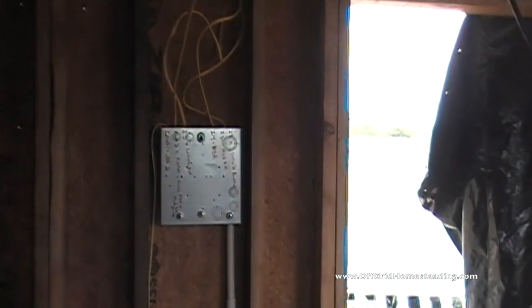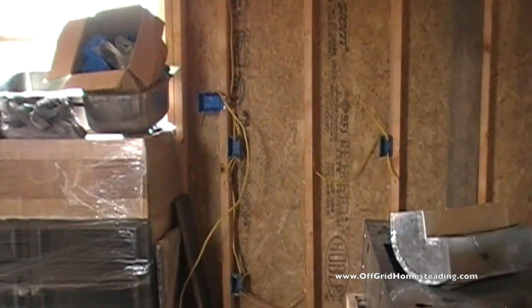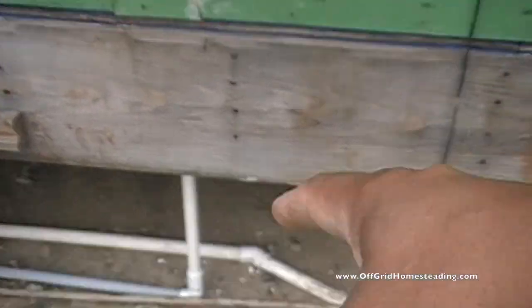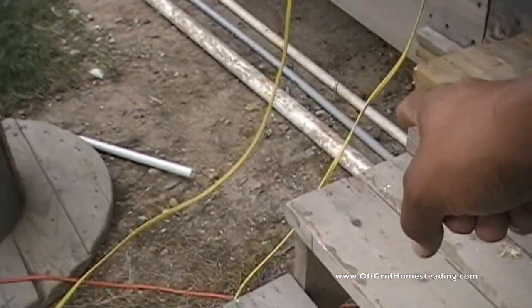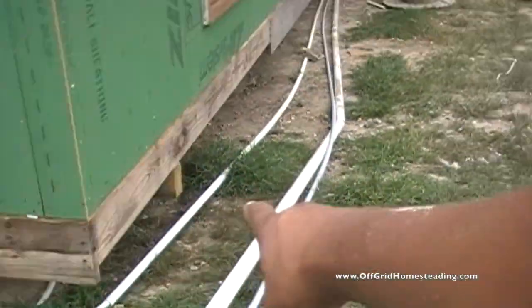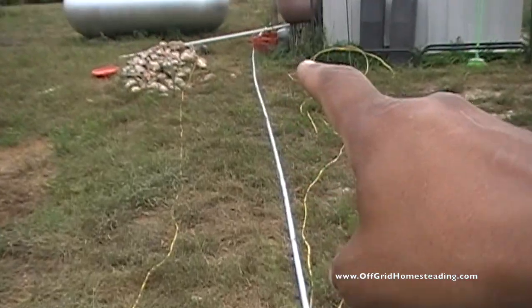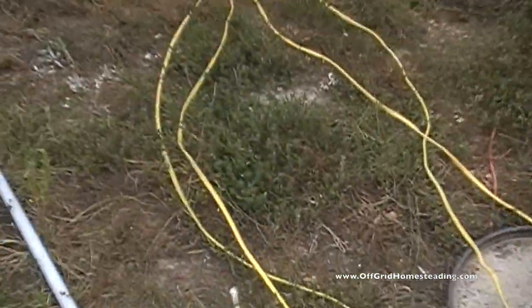Here's our supplemental power box and all the wiring to go along with that. We drilled all our holes. I have a little bit more left to do here in the kitchen — just got to finish this area, a couple of switches. We did end up having to pick up some number eight wire and ran it into this conduit here. We've got this direct burial conduit that we took all the way out here. We brought all this conduit from the center of the house and moved it to the edge since we're going to have that additional addition right there. We're going to trench all the way down to make all the lines closer to the electric and propane. We can't use the Romex we were going to use in the conduit.